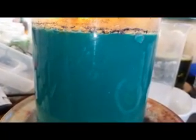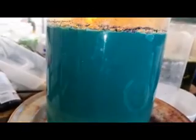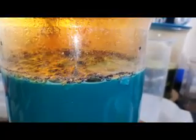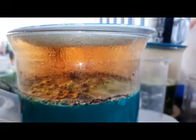So the nitric acid solution that I had in there was returned to this beaker, and a new batch of things were put in there. I keep using the same solution, I just top it up with more nitric as I use more and more things. I drain it, put all the solution, all the pulp I should say, into my aqua regia, return the solution back to the beaker and go again. And I really pile it up. You have to. You need a lot. And I can't even emphasize it enough. You need a lot of computer scrap.